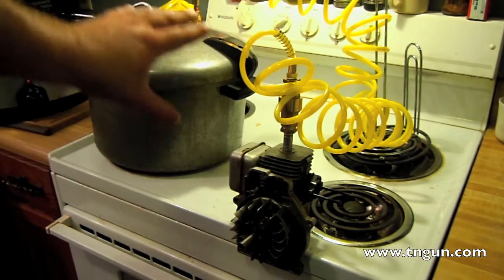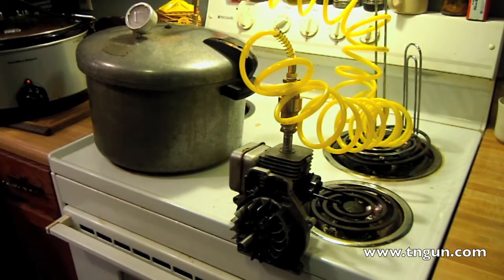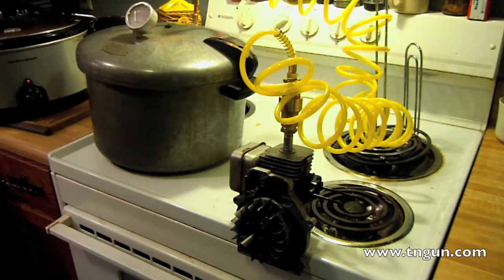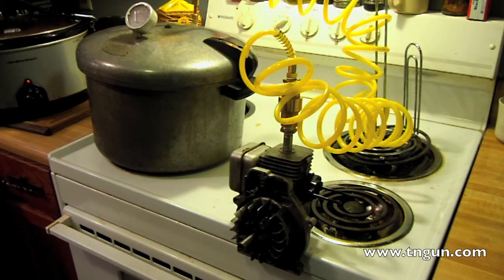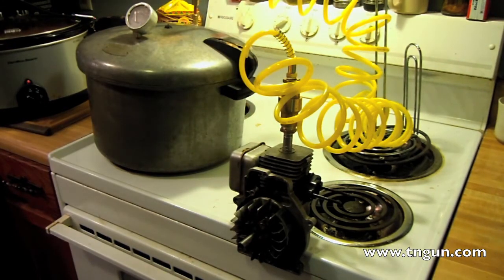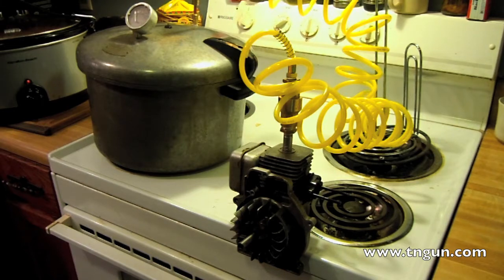As you look at this thing, I know it looks a lot like steel, especially when I don't have the plastic pulled away from the metal — it didn't melt before but I still want to be careful. But this is aluminum, and this is plastic. The aluminum would react if I wanted to use it for a whiskey still — it would react with alcohols and give you off taste and a lot of corrosion. And this isn't solvent-friendly, so the alcohol would eat away the plastic. Besides poisoning myself, it'd probably leak a lot. So this might be suitable to steam distill essential oils, but that's way out of my ballpark. This is not a whiskey still, even though a lot of the principles are the same. So we're going to build it up to temperature and come back and I'll show you how this thing's running.